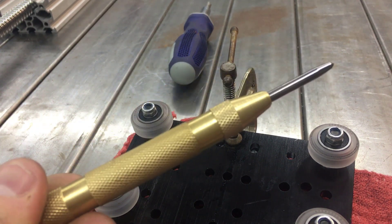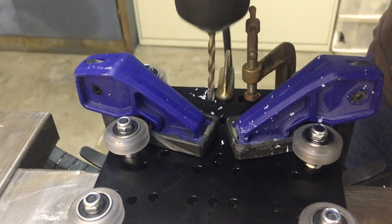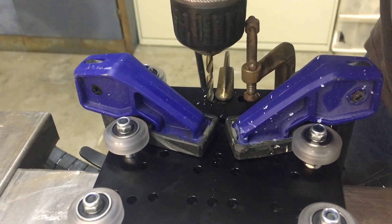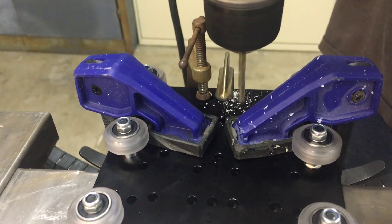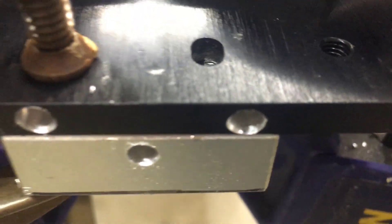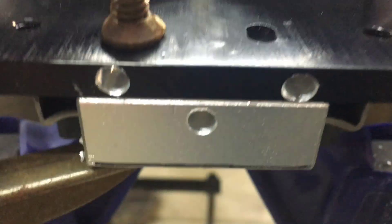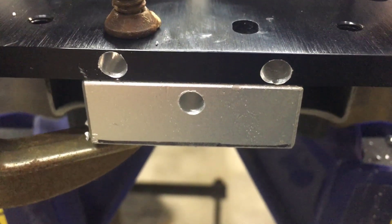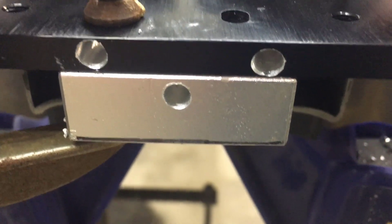Automatic center punch — you should get one if you don't have one. Here's the damage so far: drilled down through that plate, two bolt holes there with one under that clamp, and three holes here in the front. Now I just got to run some threads down. That worked good. This one is slightly lower than I wanted — my drill bit started to wander on me a bit. Hopefully that won't be too big of a deal; it's only like a sixteenth off. But sixteenths matter.